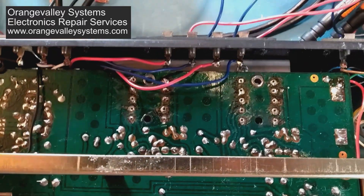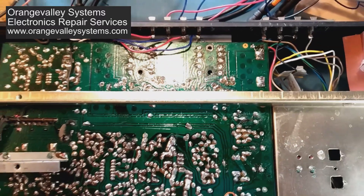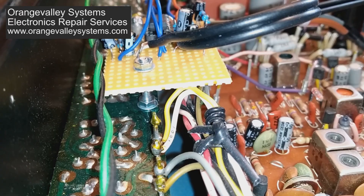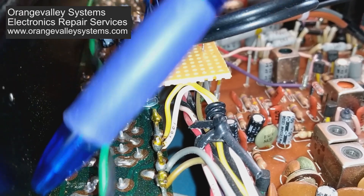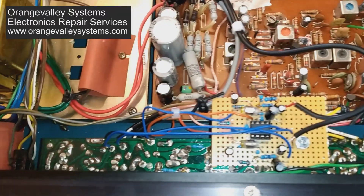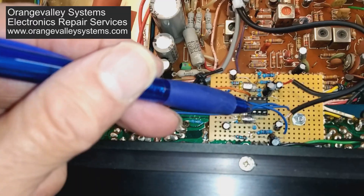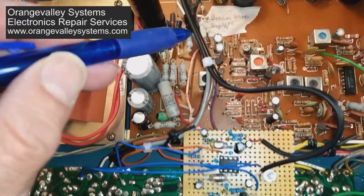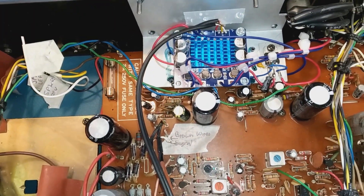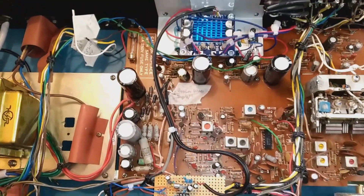This is the underside of the amp. The great thing is the speaker terminals are connected to the circuit board through wires, so I've just rewired one of them. These holes here are where the old amplifier chips used to be. I've attached my new board on top of the old tone control board, because it happened to have a hole in it, so I've put a long bolt through it. The two wires here are the outputs from the tone control board going into the input of my op-amp, and I've got screened lead coming off the output going over to the input on the Class D amp. It all fits together quite nicely and actually works quite well.